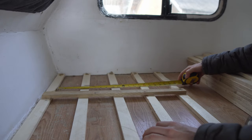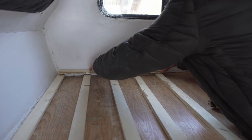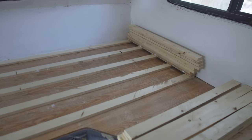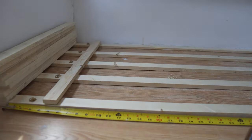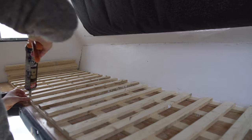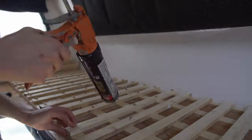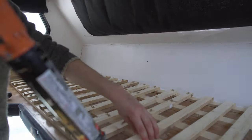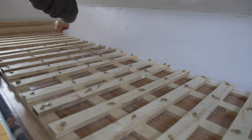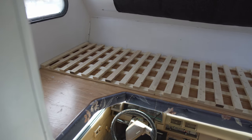That's what's going to be bonding this entire project together. I place my shorter board on top and do this on both ends to square off the entire operation, then use a factory-type method of placing all of the short boards down, putting construction adhesive on top of them, and then flipping them over. I did two and a half inch gaps in between the short boards on top, which gives enough support on the mattress so you don't feel the gaps, but when you're not laying on it the mattress springs up and has airflow underneath.